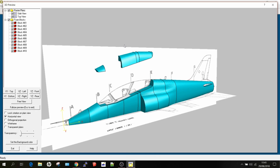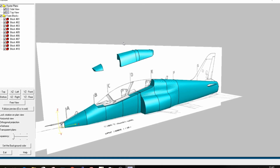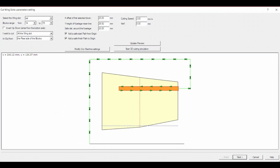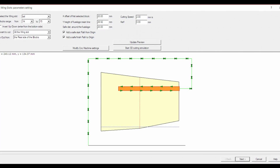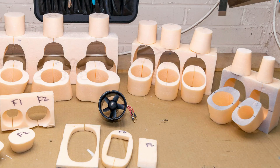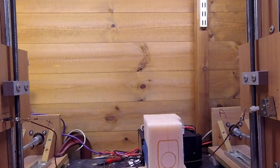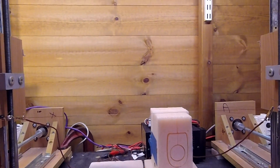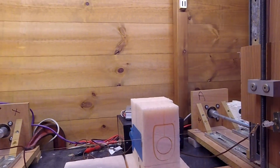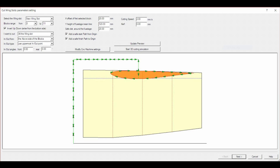This next section we'll go on to do the wing, tail, and canopy slots. I decided in the end not to do an aerofoil on the tail slot, just to do a rectangle to make it easier. You can see on DevFuzz Foam how it's going to be cut. What we need to do is place the parts back into the formers that they came out of so we can mount them on the CNC machine. I've mounted the two tail section pieces back into the blocks and pinned them so they don't move, and then the wire comes in from the back and cuts the rectangular slot.